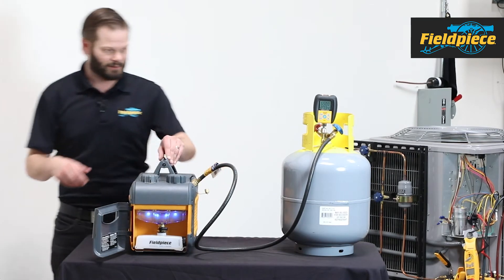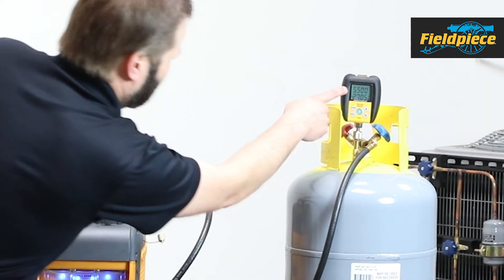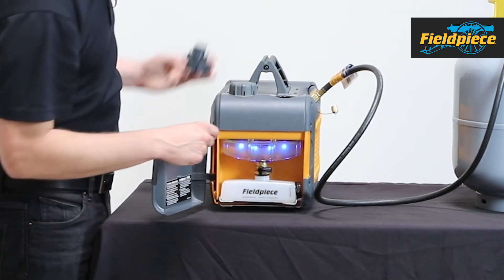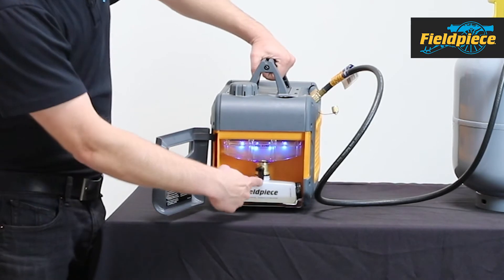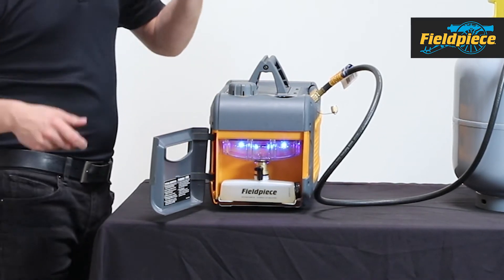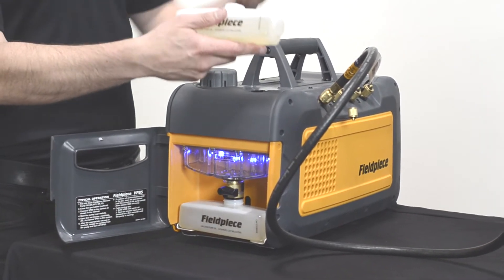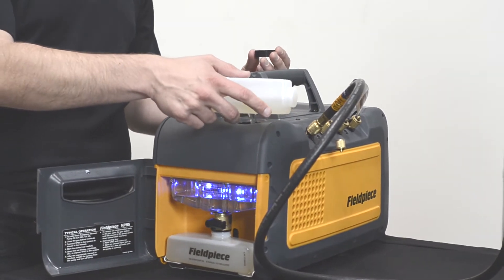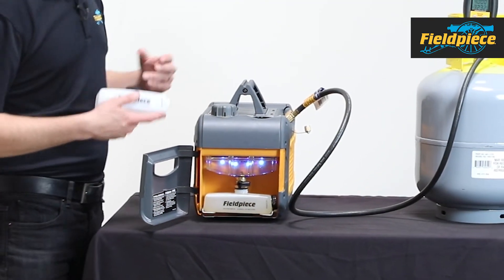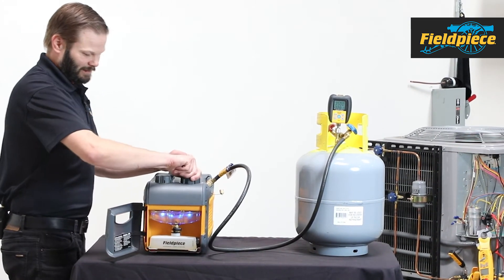Let's check out that oil change in action. You'll notice I'm at about 5,500 microns right now, pulling down that whole tank. We're going to drain the oil without losing much on the micron reading. First, open that up and flip the switch to start draining the oil — it takes about 10 seconds to get out of that compartment. I have my new oil ready to go, so once that's done I just close the valve and dump it right in. You'll notice there was no noise change when you changed the oil — it runs smooth. It can run for several minutes without an oil change, but you're better off doing it quickly. There you go — we completely changed our oil.